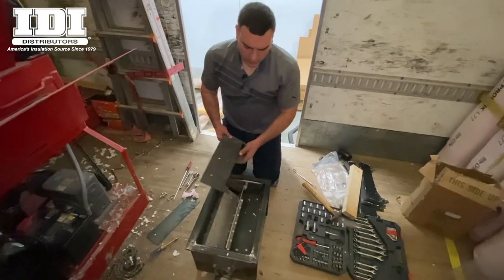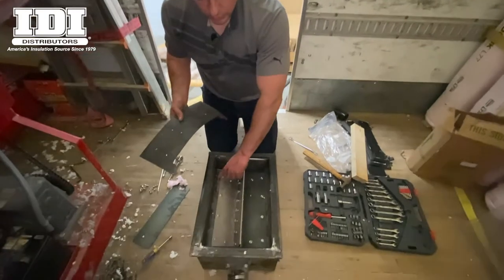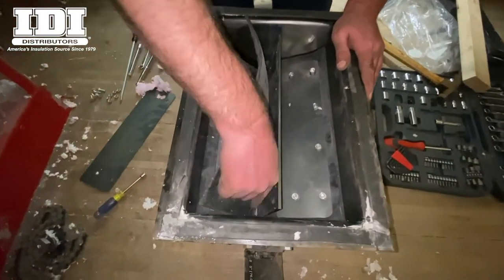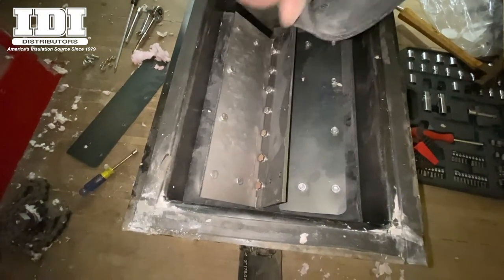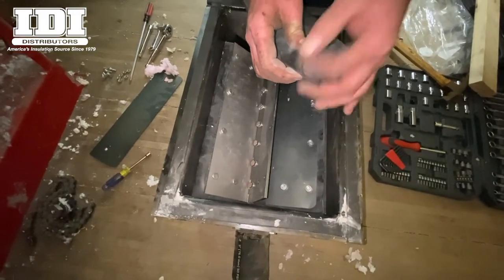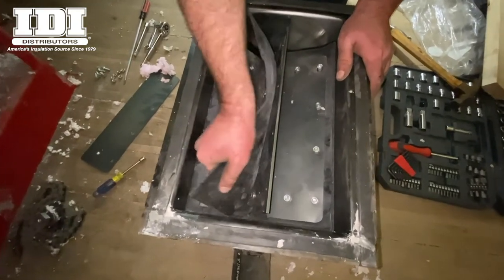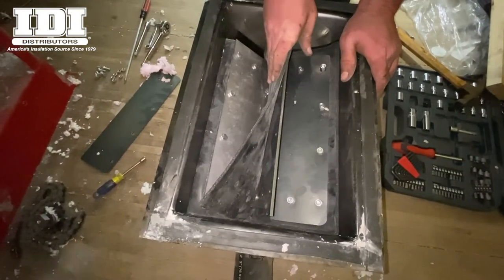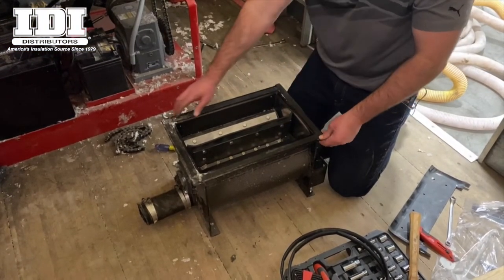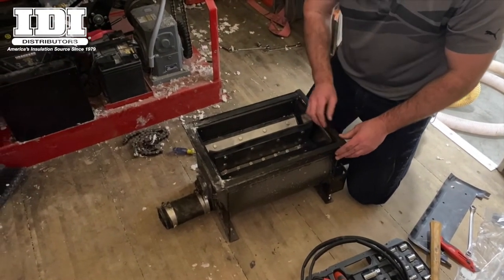When we get to the last seal, remember these tabs — we want to tuck them in, but now that there's a seal already in place behind it, we need to make sure those tabs get tucked down into the corners. If they're rolled up, you don't have a good seal and you'll get air leaking. Put that in, make sure you tuck it down around the base, and you're good to go. Now that we have our seals back in, we need to replace the seal up top here. That seal seals up to the shredder box to make sure we don't get any material leaking out.